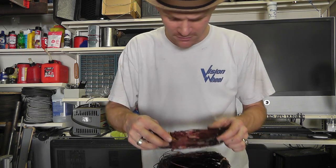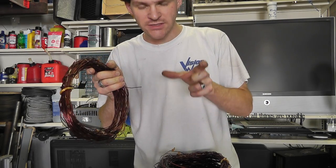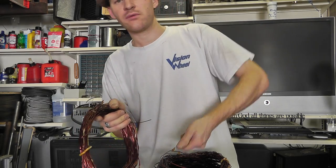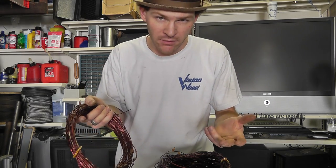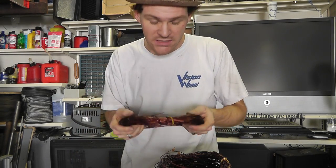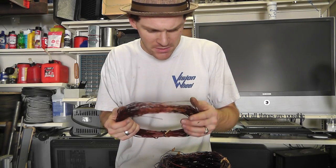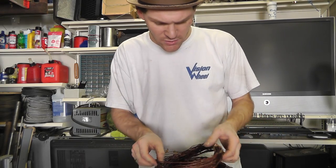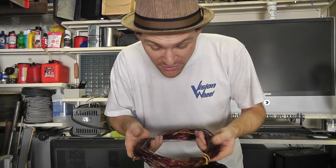I'm gonna give you a little hint: this magnet wire is actually so thick that instead of trying to pull the little slips out that are inside the core, you can actually grab the magnet wire and pull those cores out with the magnet wire. I only did that on a couple of them, but I should have done that on all of them — that's actually what took the most time. Unfortunately, I did nick up some of these — there's a few that are nicked up really bad to the point where I can't use them.